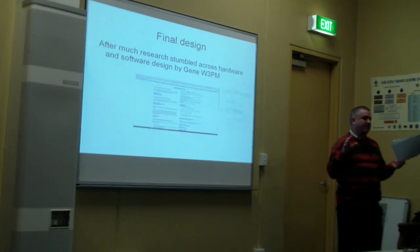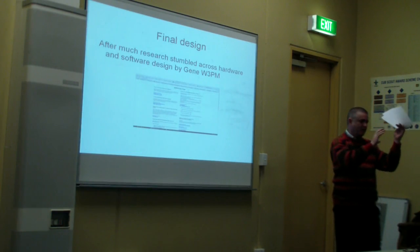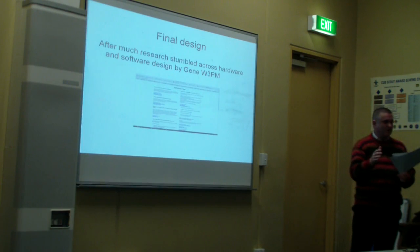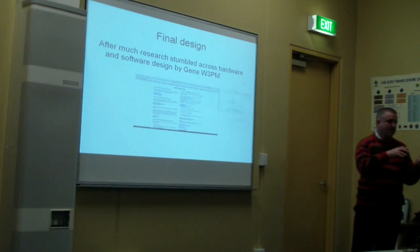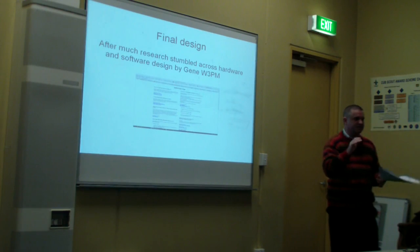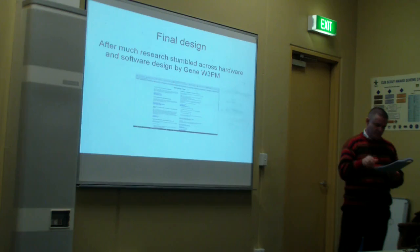anyway, if you think about my project, what I'm trying to achieve from a software perspective, my Arduino will first of all pull down the latitude and longitude from the GPS. It'll then have some code which will take the latitude and longitude and convert it into a Maidenhead grid locator. Courtesy of that project that I just built, I've now got that with the code. But there's one more piece of code that I did, and that was the ability to send those 13 characters out as a WSPR signal. It had to be code that was specifically written for the Arduino.